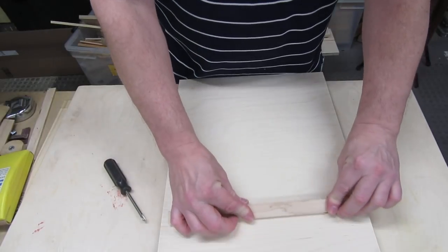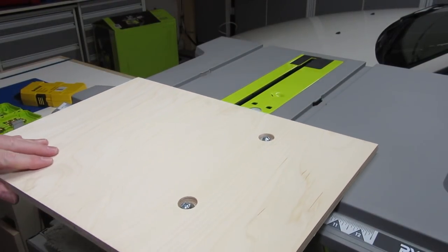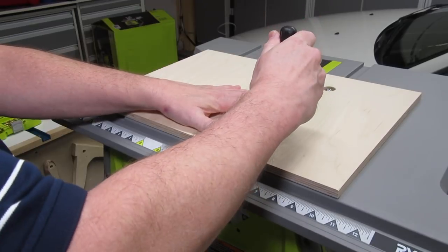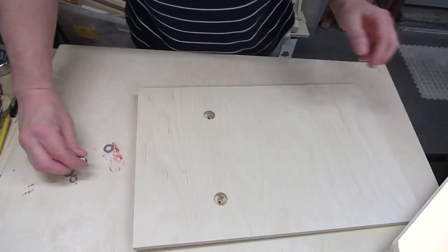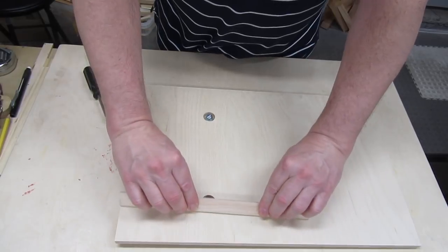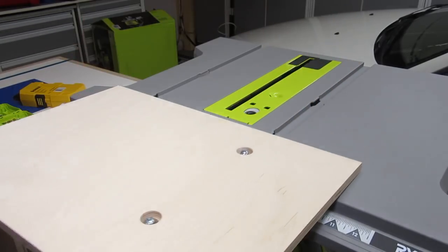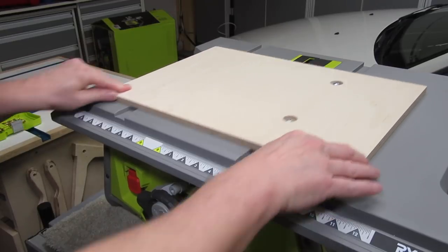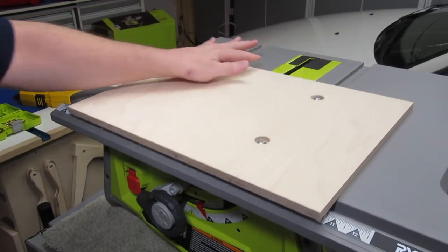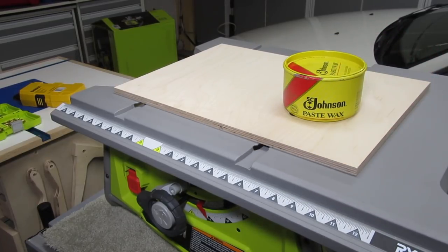We're ready to attach the runner and see how we did. Attach the runner with machine screws and washers, but don't tighten them all the way down. The machine screws need to be short enough so they don't stick out of the bottom of the runner — if they do, you'll scratch up your miter slot. Make sure the tops of the screws are below the top of the sled base. Now try to slide the runner into your miter slot. Hopefully it fits right. Line up the base with the front of the table saw so you're relatively square, then tighten down the screws. If they don't seem like they'll hold very well, use some lock washers. Double check to make sure the screws are still below the surface of the sled. Back at the table saw, try sliding your sled back and forth. If it works, you're pretty much done. If it's only just a little too tight, it might help if you wax the sled bottom and runner. Otherwise, go back and adjust things until it works. If you get totally stuck, leave a comment and I'll see what I can do to help.